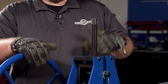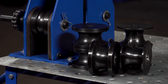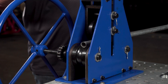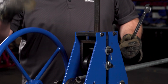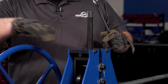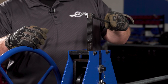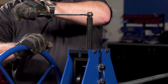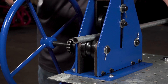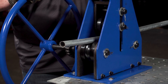Once you've got your size, this unit comes with three different die sets. The one in the model right now is a one-inch die set. It also has a one-and-a-half inch and a two-inch die set, depending on the size of pipe you're looking to roll. We're just going to put some tension down on the unit — it's got a nice big wheel to create more leverage — and you may have to do this a few times to get that bend radius. Be mindful that you don't over-bend it; you'll start to kink the tube and then you'll have to start over. You'll start to see the tube want to come upwards, which just means we're putting more and more tension on the pipe, and it'll start to create its bend.